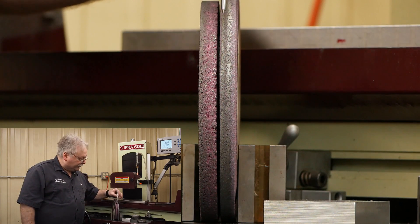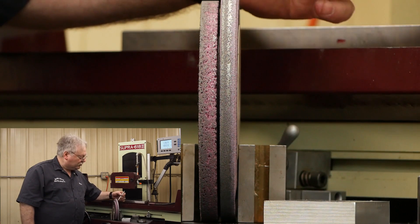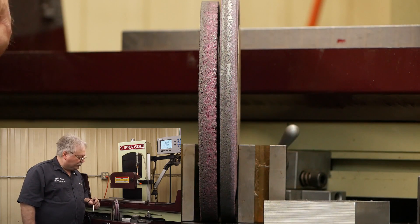Here's the second wheel that we were using — that was the 60 grit K structure. Here's the leading edge and here's the trailing edge. If you look on this trailing edge, there's no load. It's all on the leading edge. And it's just the opposite on this porous wheel.